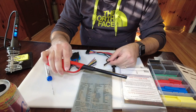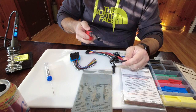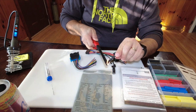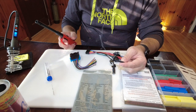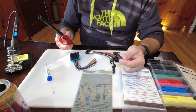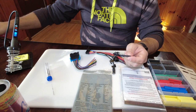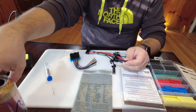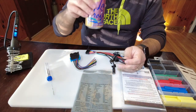What I've found is that one of these cheap lighters will work to shrink heat shrink. You just light it and hold it under there — look what it does. Just move it around a little bit and it shrinks right up. You have to be careful not to hit the plastic on your wires because you'll melt them. I'll just shrink the middle portion that's covering the connections. Oh, and you need a LaCroix — you don't have to have a LaCroix, but everything goes better when you have a LaCroix.